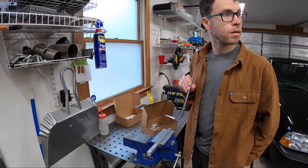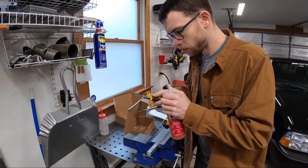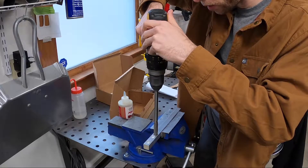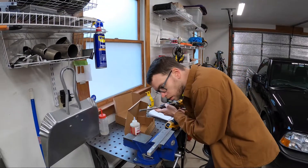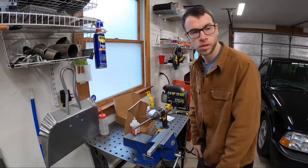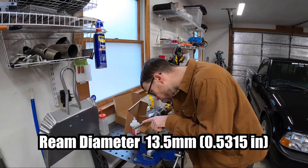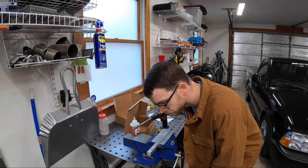Not sure how I'm going to hold this — probably have to use the drill. Here we go. Not too bad, probably nicer if I had a drill press but let's see what it measures out at. Pretty much perfect — I'm measuring 0.535. It says 0.5315 on the ream, so it's about 4 thou over, probably because I'm not holding it perfectly straight. I think that'll work.